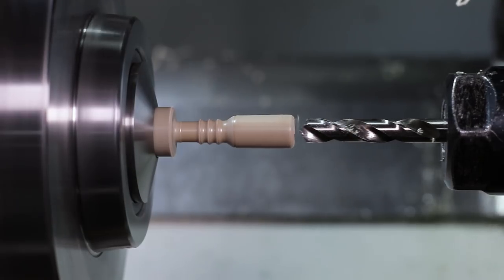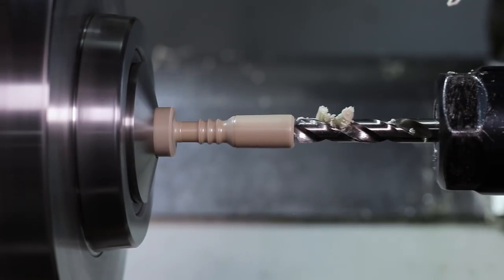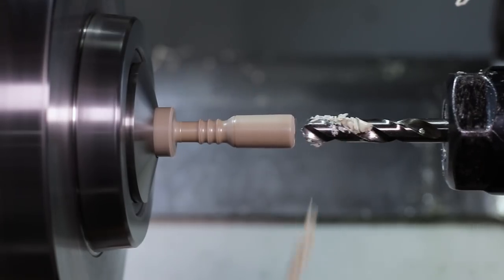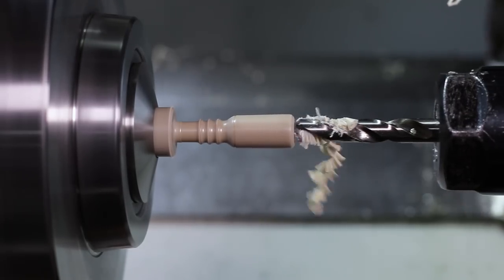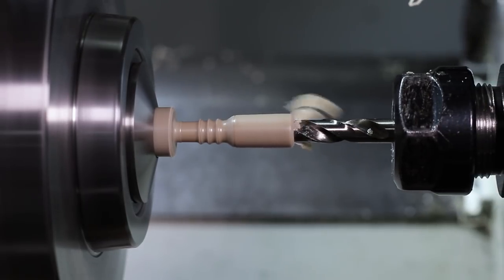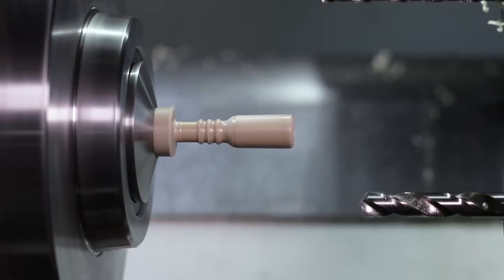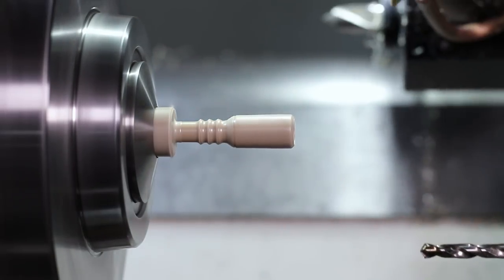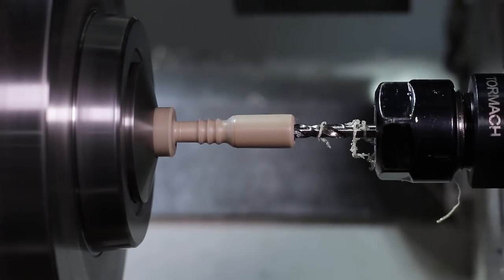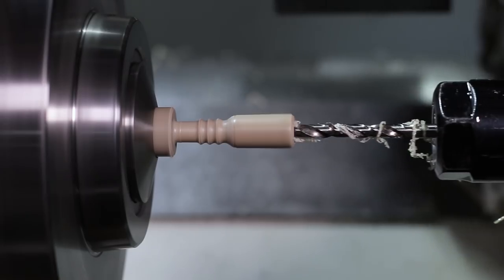After all that OD work is done, we come in and drill the internal holes — that significantly weakens the part, so we want to do that at the very end. The other way to improve this would be to support the material with a tailstock. Tormach does sell a tailstock for the Slant Pro, but I don't really like it — it's pretty cumbersome and awkward to work with. Really this Slant Pro is a chucker-style lathe, so obviously these parts would benefit from some support down there — we just didn't have a way to do it here.